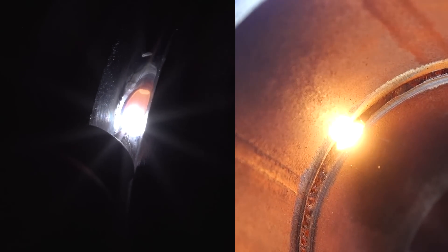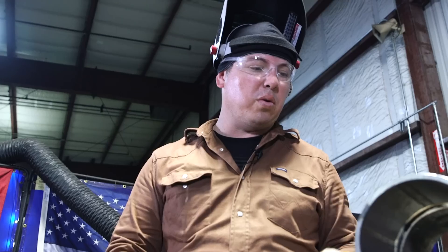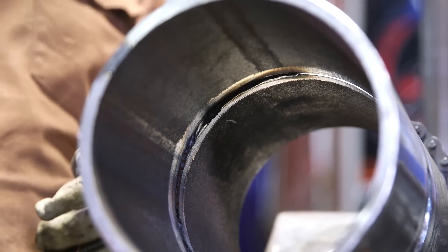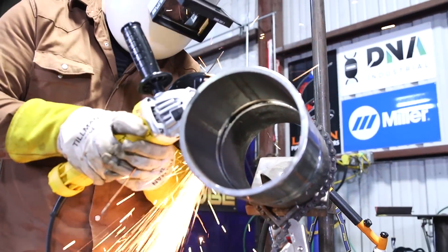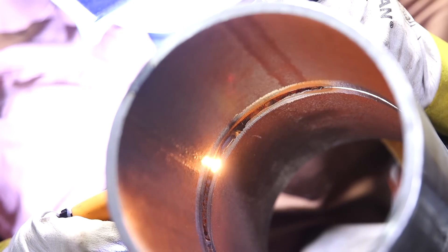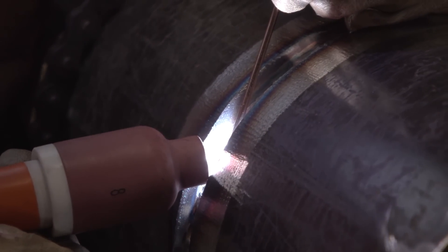We're going to go back and do this again - you can kind of tell it's pulling metal up to the top. We did pull that excessive penetration out. It is just a little bit on the flat side. So what I'm going to go ahead and do is grind it back again, put a little bit of metal back in there, just so the root looks a little more uniform. That still passes - the bevel edges are burnt. We're basically doing this so it looks aesthetically better.